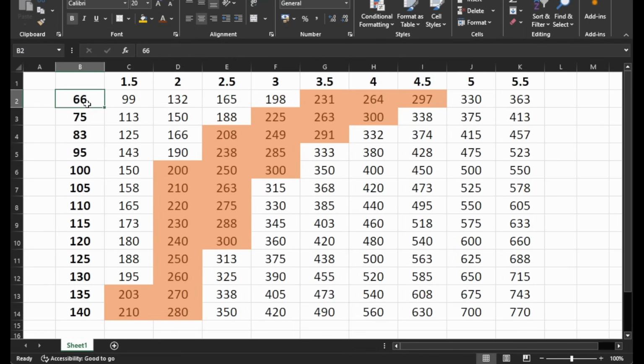Currently we run at 66 megahertz and a multiplier of 3.5, which gives us the 233 megahertz. So for now I mark this as green, and we can move on to figure out another frequency. The easiest one would be to just change the multiplier from 3.5 to 4, but that would give us an increase of 33 megahertz. That might be too big of a step. So let's see what other frequencies we have.